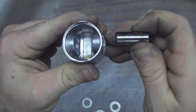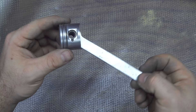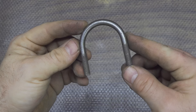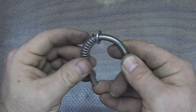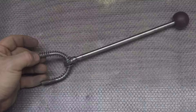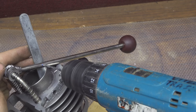Now let's make the last modification: I will create a lever for the piston so I can compress it. Water goes inside the cylinder and then the piston compresses the water down — the piston is the pump for the water. To apply more force, I took a stainless steel lever and a U-shaped bolt that fits into the two existing holes of the motor. I'm lucky that all the components fit together very precisely. I drill a hole through the lever and through the piston so the two now move together.